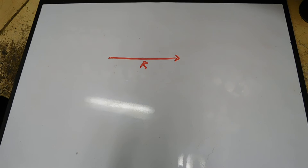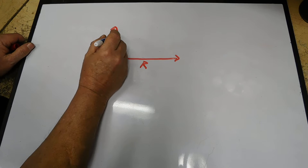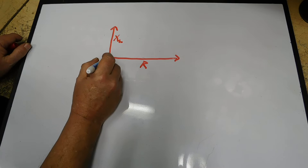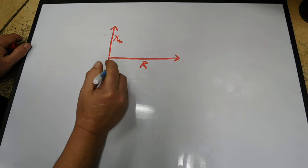Going from this point up, we're going to put inductive reactance, which is marked X sub L. I did videos on what inductive reactance is and what capacitive reactance is, so you'll have to look back over those. There's one other one - I said there's capacitance in there - it actually goes down. It's going to be smaller because it's mostly an inductive coil, so I'll shorten it a little bit here. That's X sub C, capacitive reactance. And I know my voice is crackling - it's basically because of the cold.